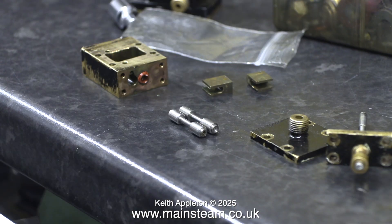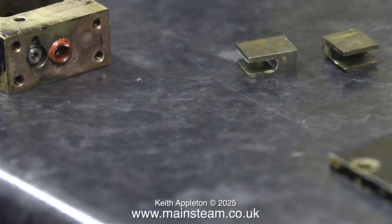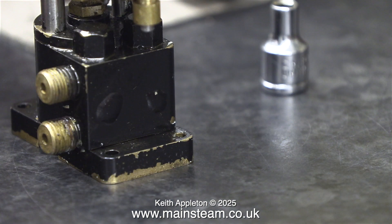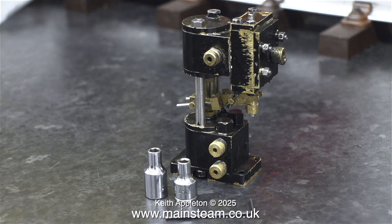These are the shuttle pistons and there are two of them. The owner of the engine made a replacement but as far as I can see there's nothing wrong with either of these, so for the purposes of testing I'm going to fit the original shuttle valve back in place. These shuttle valves really are a separate piston in a separate cylinder inside the pump — so really these pumps are twin cylinder, and the shuttle valves make it so that the pumps are self-starting. They can be fraught with difficulty, but I don't think this problem is to do with the shuttle piston.